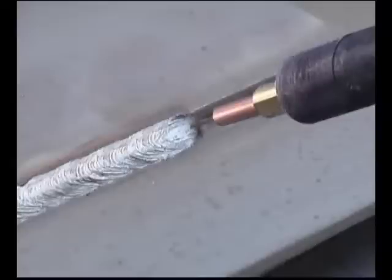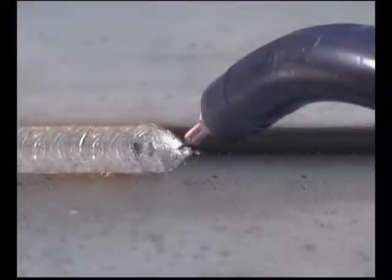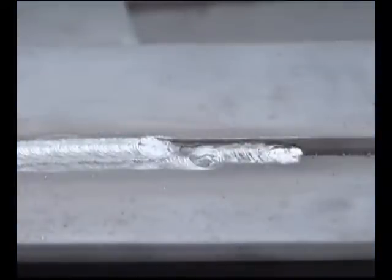The heat of the arc will not be directed onto the base metal, limiting penetration. To melt and fuse the bottom corner, keep the wire towards the leading edge of the puddle. For more weld buildup on heavier metal, you can either increase the voltage and wire speed or stack overlapping weld beads to provide the required amount of weld deposit.